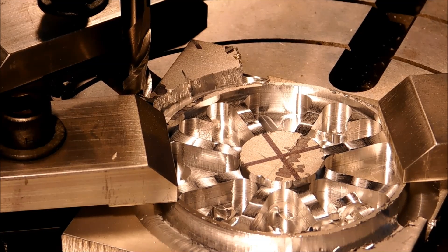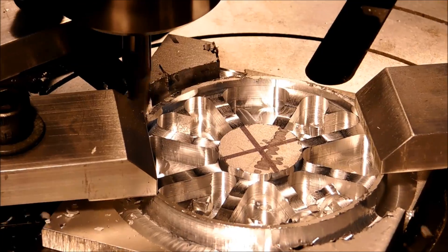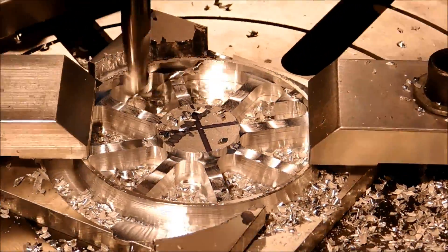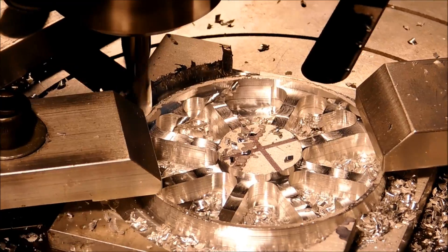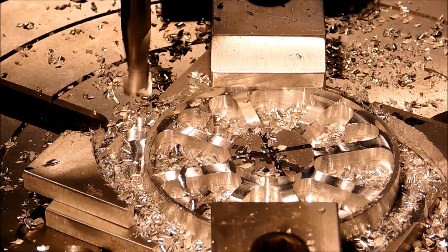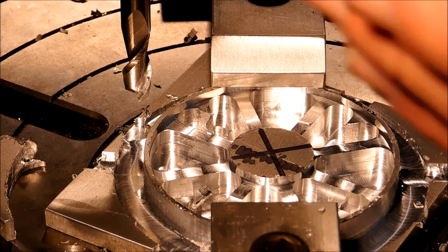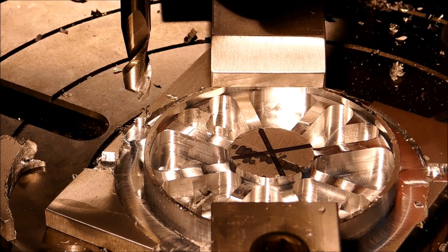Okay, let's finish it up. If you may have noticed, at the end of my cut at the blend area I will always feed off as opposed to stopping midstream. If you stop a cutter midstream, chances are it's going to relax and leave a vertical footprint — so don't do that.